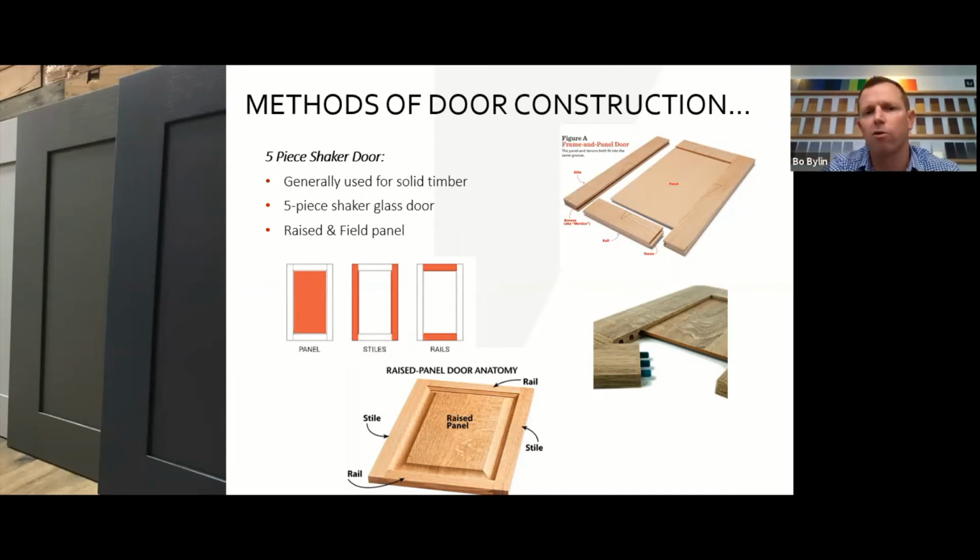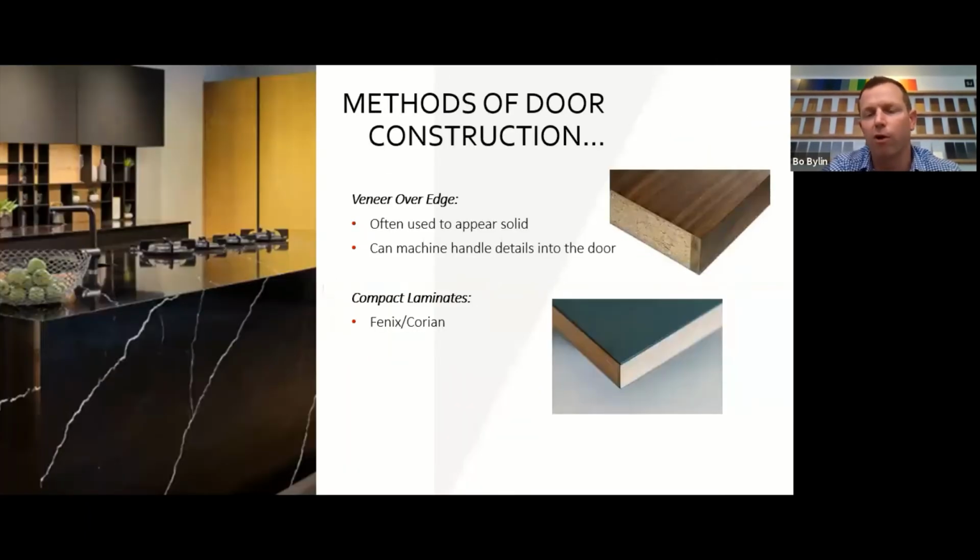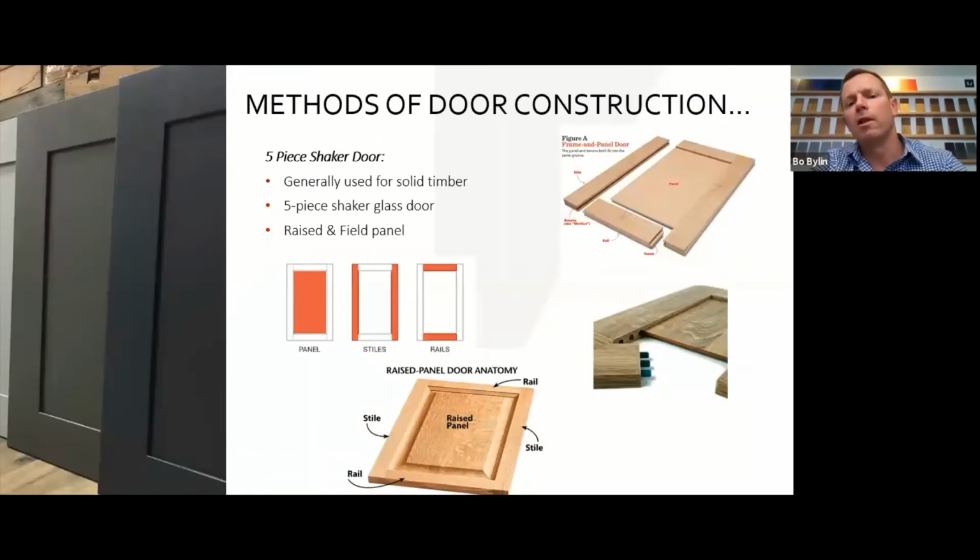This is still very popular amongst people going with this farm style, country style shaker look. So the option of doing that in a sprayed MDF or board without any texture is very, very popular, believe it or not, should you not want to go the contemporary route. The shaker is also available down the bottom. Should you want to bring in some other detailing, we call that center panel a raised and fielded panel, and you're able to give it a bit more detailing by routering either a chamfer or a curved rebate around the side.